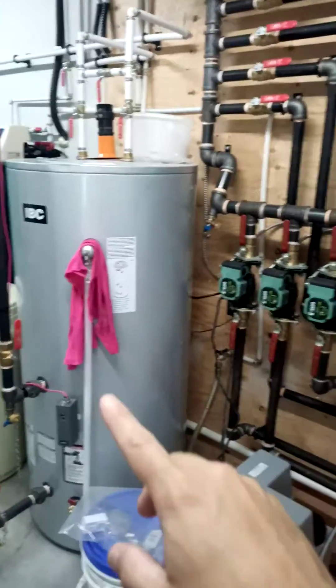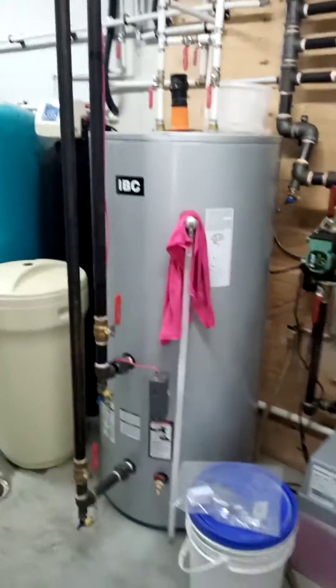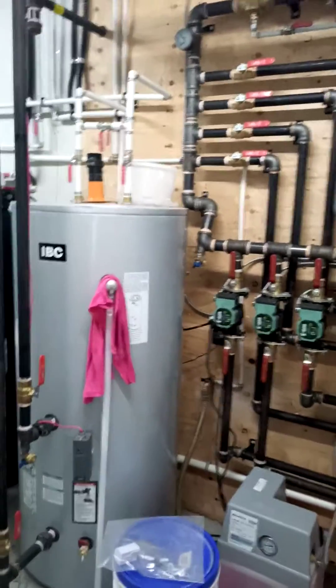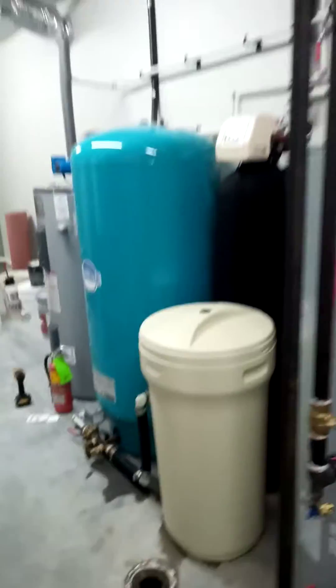This one should not come on ever, and that's floor heat through the whole house, which I'm going to try to figure out if I can use the smart load for as well. It's a very efficient, very airtight house — built with 9.25-inch walls, all insulation, no thermal bridging. I'll do more a video on that later; it's a different wall concept from Greenstone Building Products. There are all the different zones and whatnot.